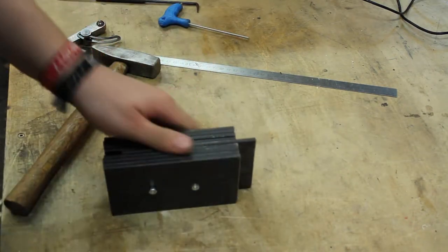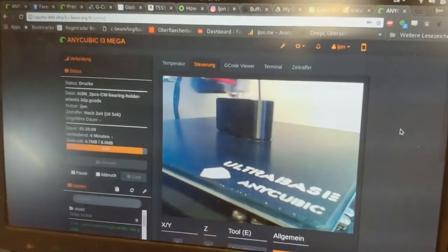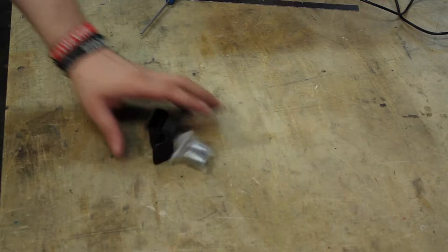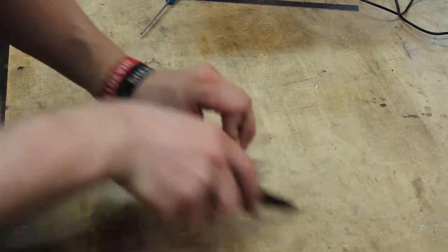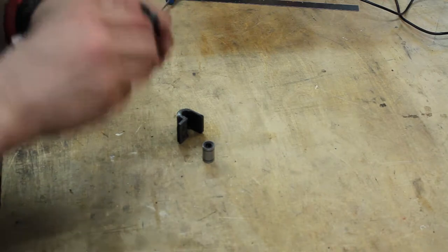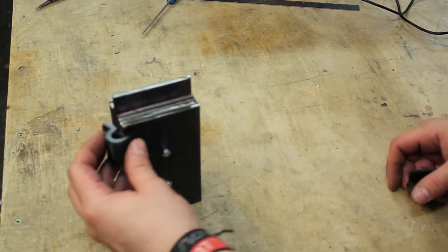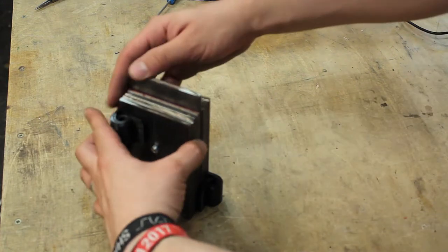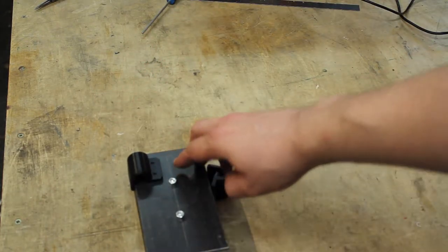And here it is — the counterweight. Not yet completely done, but well underway. While I was working on this part, the bearing holders that hold the linear bearings are also nearly done — it says 94% done. And here are the printed parts. Let's see if they fit. Looks good — perfect, exactly as I wanted them to work. This one goes on like this, and the other one goes on like this. Next step is to drill these holes and tap an M3 hole in here.